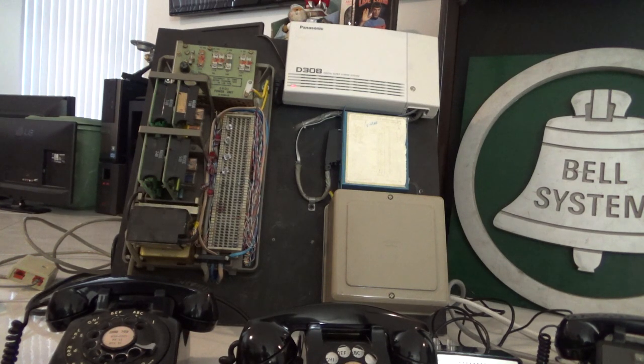Below the Panasonic KSU I have a Valcom V119RT — RT as in rotary tone. That is a dial intercom unit with up to 29 buzzing signaling ports. You can have up to 29 extensions that have a buzzer, and those are hooked up through the fifth line position of the six-button key sets. Each six-button key set has a buzzer and you can call and buzz each of the phones with that intercom unit.